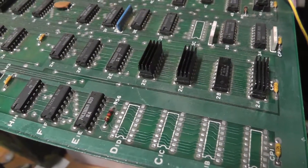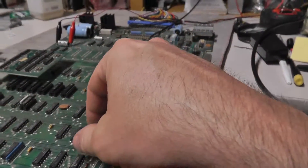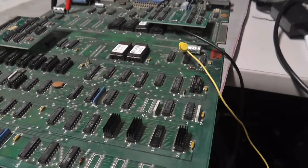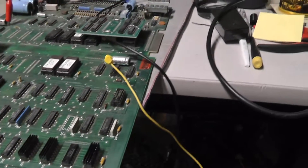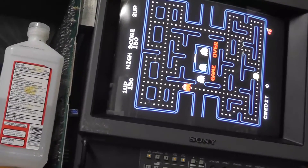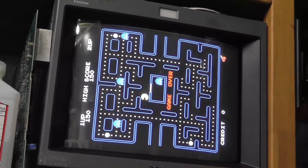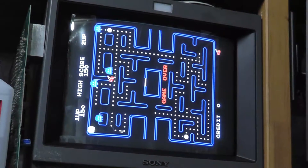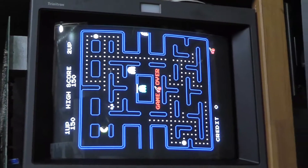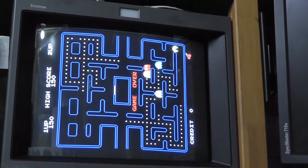The counters looked normal — I even hooked up to another board and it looked the same, so I figured 1E and 2E were good and the problem had to be downstream. When I was grounding out the RA address lines just to test, you should see the characters change position on screen — every time I touch them the characters move somewhere. When I was doing that, it all of a sudden started working again. It's almost like one of those RA address lines was stuck, and by grounding it I unstuck it somehow, but I don't know exactly how.